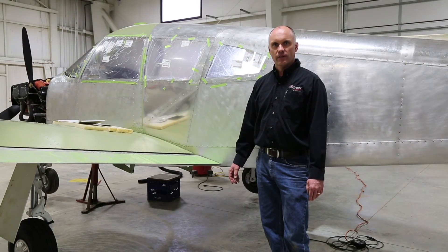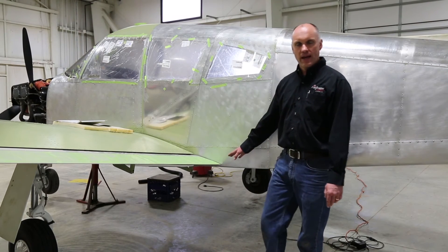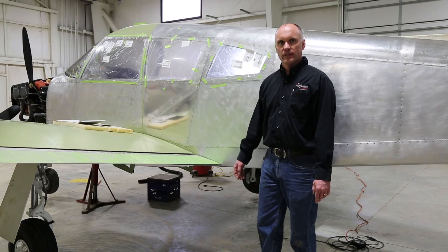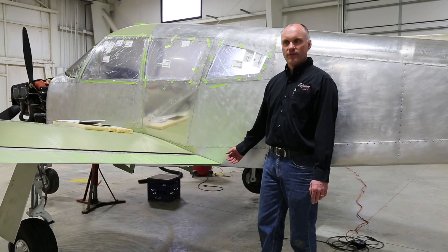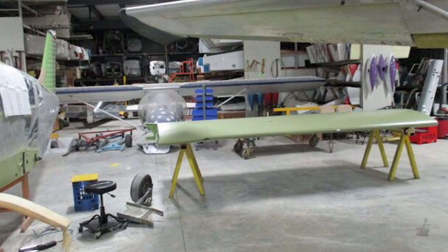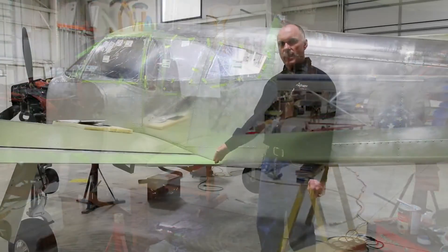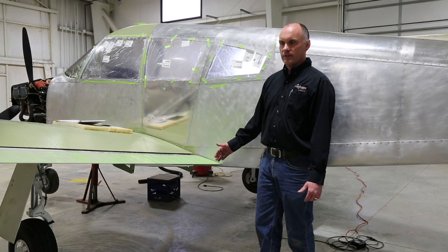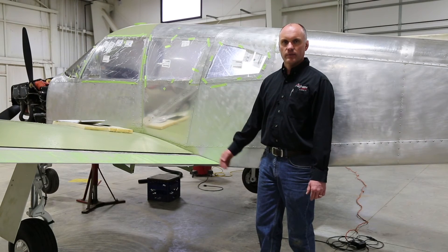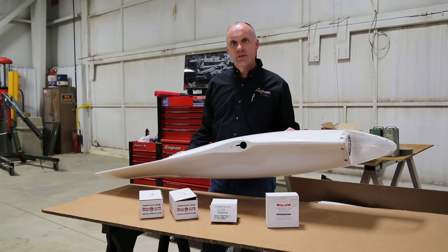As you can see, with the wings installed, the flaps and the ailerons are installed on the aircraft as well. One interesting note: we installed the wings back to the original settings, but when doing a symmetry and water line check, we found the wings were off from one side to another by about a quarter of an inch. So we had to re-plumb this wing, reducing the angle of incidence on the wing to match the other side, and hopefully creating a faster aircraft as well. Both wings are now the same side to side.